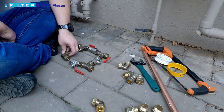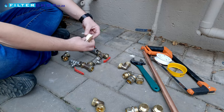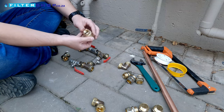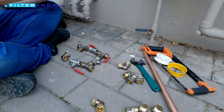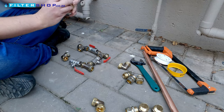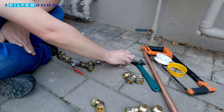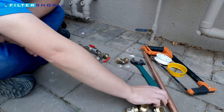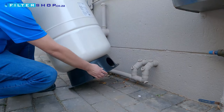If you are just having short outages, the upside is you don't need much backup water. If however you are without water for a few days at a time, the setup of a large tank and a pump is probably the way to go. For some perspective, a modern efficient toilet uses between four to six liters for flushing, while some older toilets used as much as 20 liters per flush.